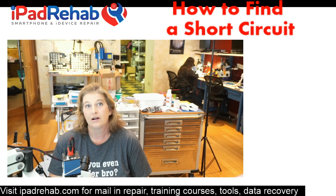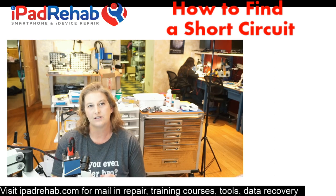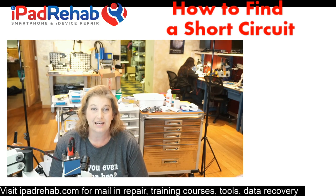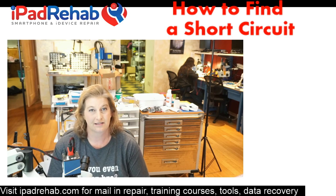Next, we looked for candidates: which one of you guys is giving us the middle finger? And we found that it was a mechanically damaged cap out by the home button or Mamba connector on the 6S. That made it the highest ranking candidate for the reason why we had a short to ground on that line. So kicking it off has solved the short.